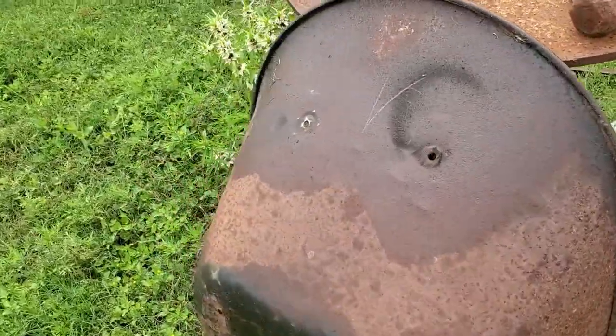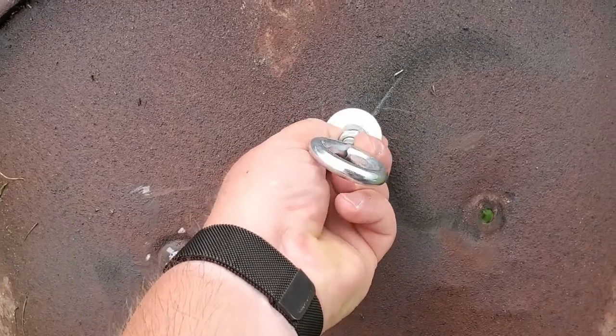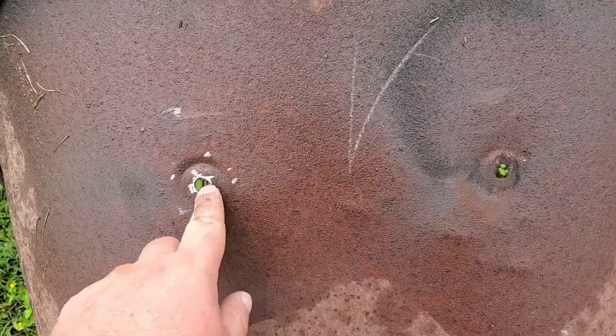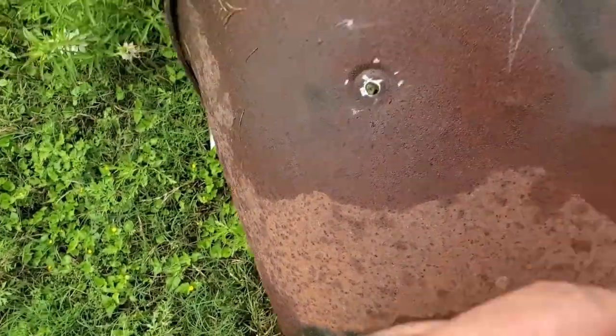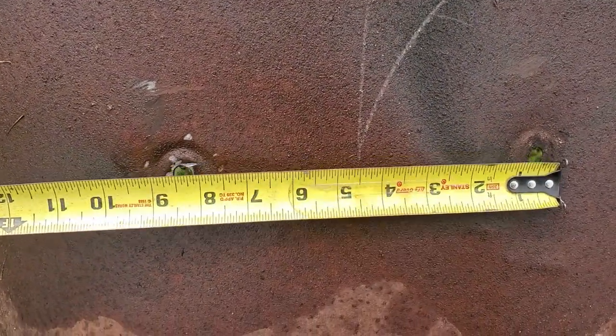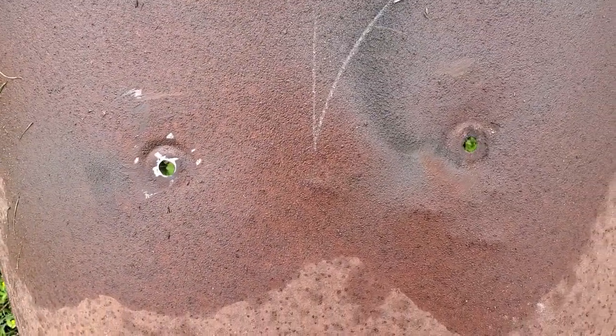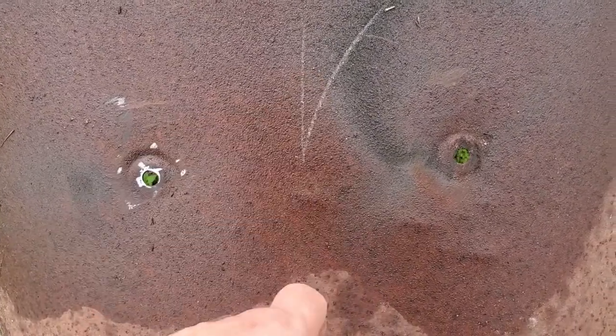Well, we got to lean it up here. Where are you gonna put this bad boy? You know, drill it in here somewhere. How do you know where center is? Well, it ain't real hard — you got two holes right there, you just got to get the old measure tape out and measure in between them. We had eight and a half, so we made a mark at four and a quarter. Now we just gotta make our mind up — we want to drill it right here, or go up or down a little bit. I think we're going to just put it right there in between them somewhere.